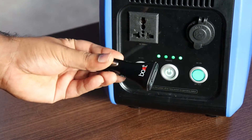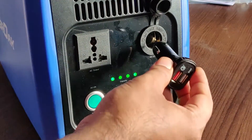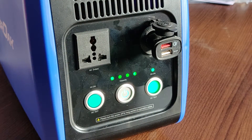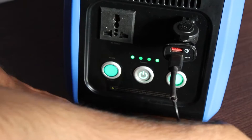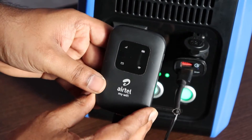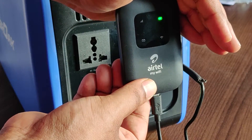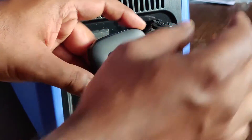The 12V DC output lets you connect a cigarette charger to charge your devices, or run 12V DC appliances like a table fan or DC lights. Now, converting battery power to AC and then back to run a 12V device is inefficient — so if you want this to last longer, use 12V devices directly, like a 12V table fan, which will give you much longer run time.